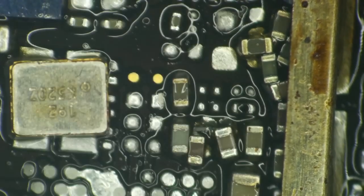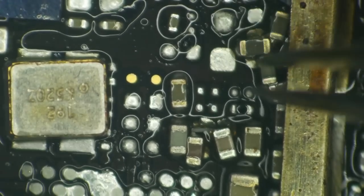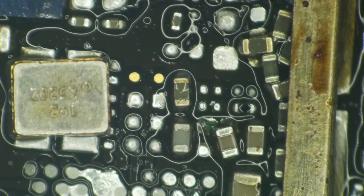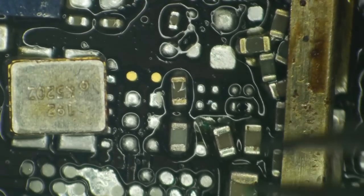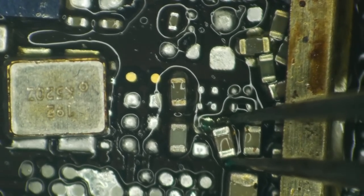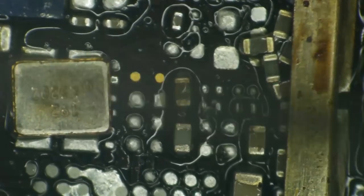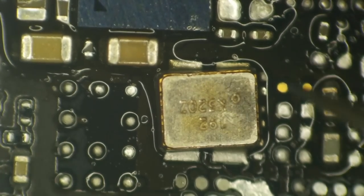There's a lot going on here with the control of this hot air. For people new to this, you'll notice that the very second I see solder melting, I'm pulling back on my hot air. I'm running this board right up to the very minimum temperature I can use to remove this stuff. The last guy that worked on this didn't overheat the board — the RAM still looks okay and we don't have any ball squeezage around NAND. I'm going to leave this oscillator for now.